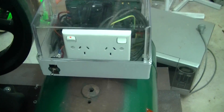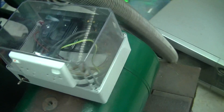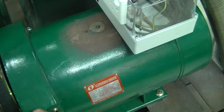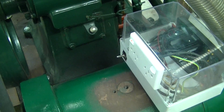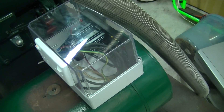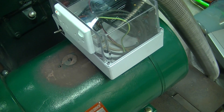There are a couple of test GPOs on there. I've set this up temporarily, but I would be putting a circuit breaker in there as well — probably either a 16 or 20 amp breaker. This is a 7.5 kilowatt alternator, but the Lister is only 6 horsepower. So if it was actually producing 6 horsepower output, we might be able to get about 4.4 kilowatts. You'd want your circuit breaker slightly lower than that, maybe 4 kilowatts.